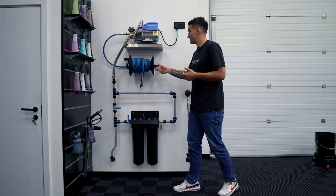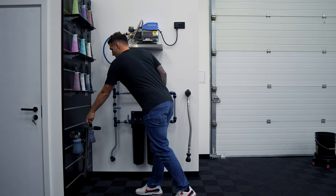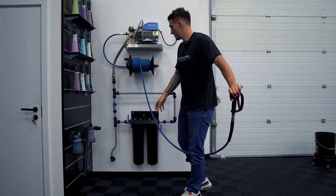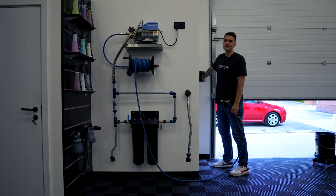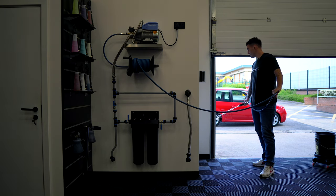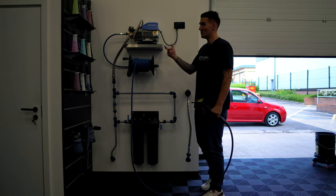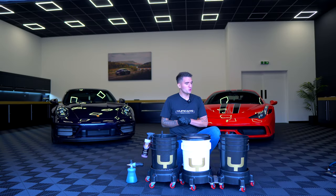I like to run the line off pressure - just to get any air out of the hose, so that when you turn it on you're not pushing potential air pockets at high PSI and high flow rate. I just unlock it, leave the gun and lance for now, hook it up, and for about 10 seconds I literally just run the water. You'll hear if there's air in the line - if there's air you'll hear a splurting sound. No air, no splurting - fantastic. Then I unwind it off pressure because it's easier.